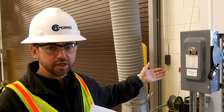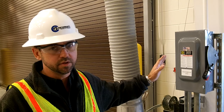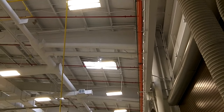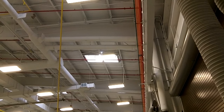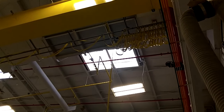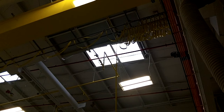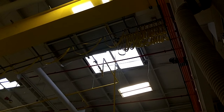I'd like to start with the disconnect. This is the manual disconnect for the entire bus bar system. This is the only way to disconnect or de-energize the power to the entire bus bar system. The orange and green bar that runs down the length of the runway is the bus bar system — that's what carries the power to the crane. The crane feeds from the collector shoes. That bar is open at the bottom. It is hot. It's finger safe, meaning you should not be able to get your finger up into the energy bar. However, it still is a safety item you need to be aware of.